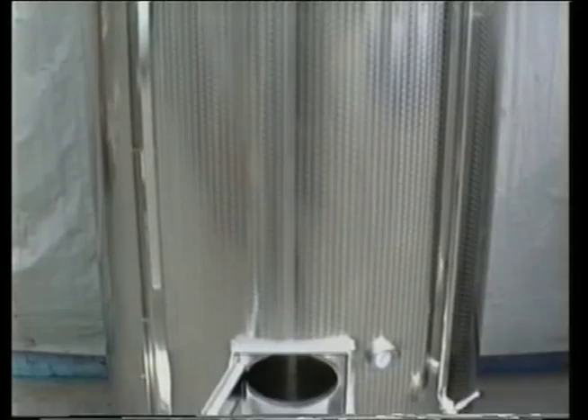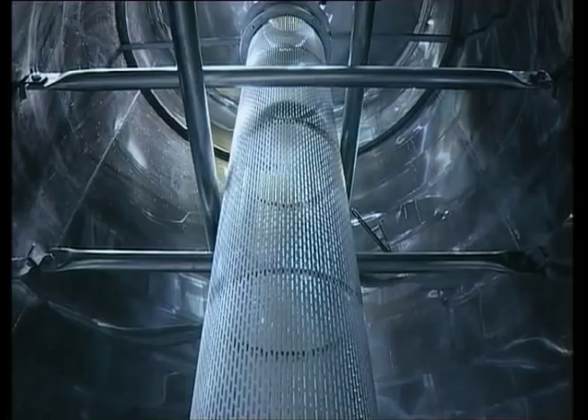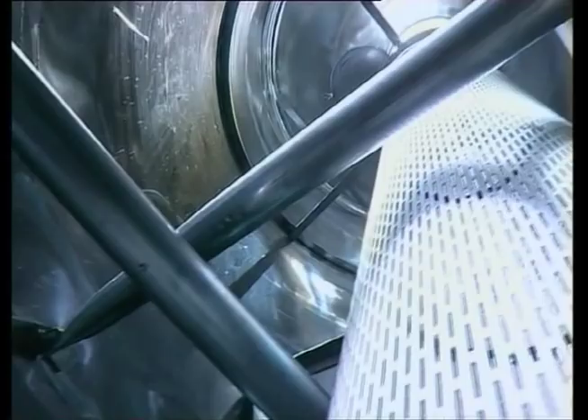This mechanism is ideal if used in conjunction with a manual delestage system, because two effects are achieved. On one hand, the lowering of the cap and then its aeration and breaking up, since this can be combined with a head-breaking pole system. And on the other, the dissolving and disrupting of the cap by means of the movement of the must and without the motion of mechanical paddles.